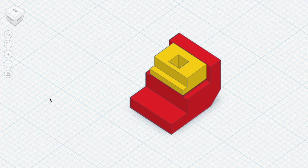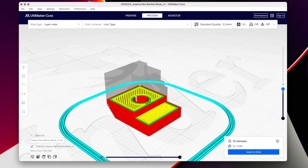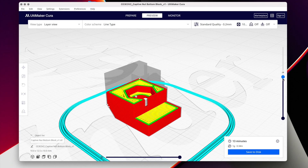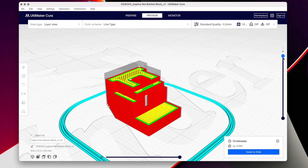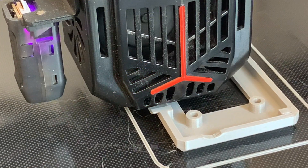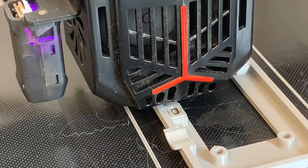This is when we need to drop in the nut before subsequent layers print across the hole. Going through the layers in the slicer we've got the round hole for the end of the bolt, the hexagon for the nut, and two more layers above its thickness — that's our window of opportunity for insertion — before the print head comes over again trapping it in place. Note these layers aren't printed on the nut but over it, which is why I've gone for straight sides rather than a round hole.